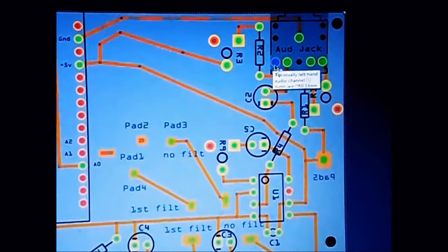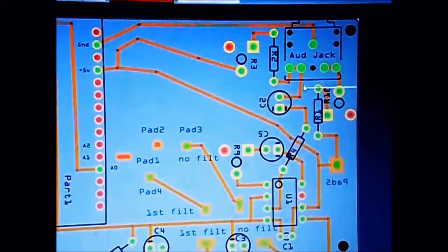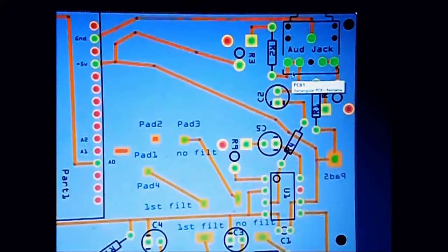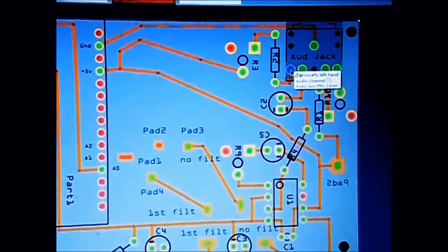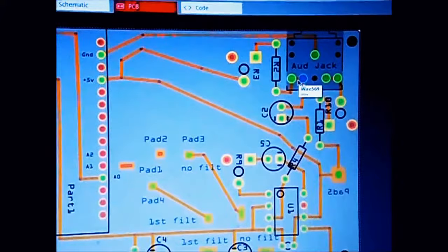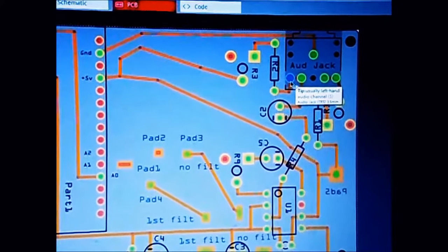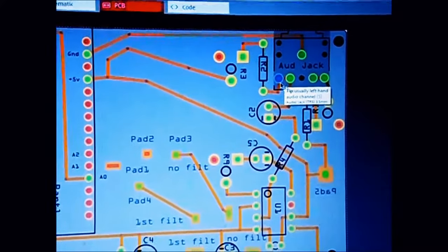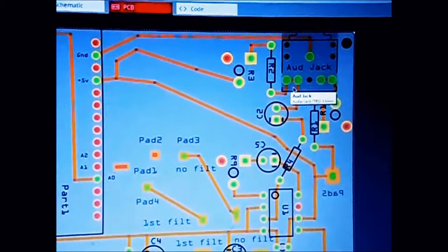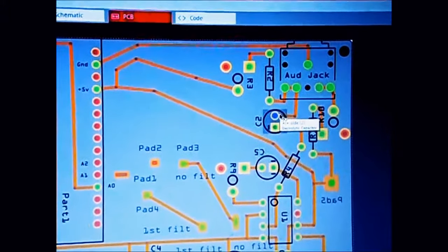And then your signal, when you receive some. If you don't receive anything, it will be 5 volts. So you have roughly 200k sensitivity here, and if you receive signal, it will drive it to the ground. So your signal will be different between 5 and 0. Obviously, because of the 200k it won't go that much down to 0 volts, but you will be able to fine tune it yourself this way. Then the signal goes out into a capacitor. I will get back to the signal after.